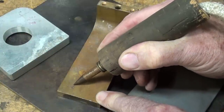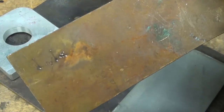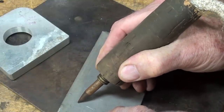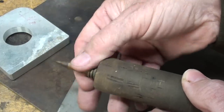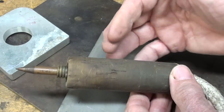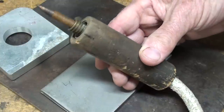This is brass, but copper would be the same way — it's way too conductive. But in fact, I'll put my name in there. Well, I've got to eat my words — there it is etching a little bit, which surprises me. Its real forte is etching steel, hard or soft. You've got to be careful not to touch this because it will get hot — it's already pretty warm. But the cork really insulates. The modern ones are made of cork too, and quite often now when you see cork used in modern products, rather than being a solid piece, it's cork that's been ground up and fastened together with an adhesive, like you see on bulletin boards or on gaskets.